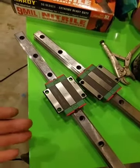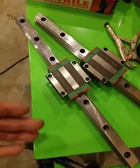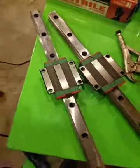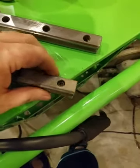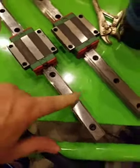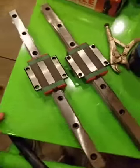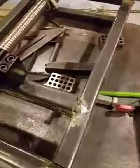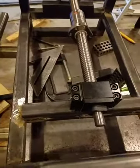In practice that's not really true. I would say 20 microns is probably ballpark, but I've had them as far out as 50 microns and they still work, though you can tell they're a little gummy. Since the screw has a little bit of slack in the hole you can actually move the rail back and forth probably close to a sixteenth of an inch to get it lined up. These rails aren't guaranteed to be straight — they're supposed to be straightened against part of the machine bed, which I don't have on this press. I think if you used SBR rails or even optical rails they'd work just as well and you wouldn't have to be nearly as critical on the alignment.